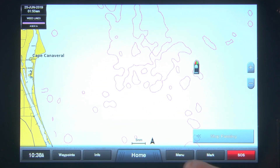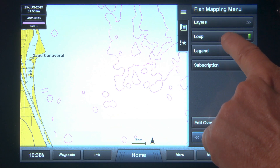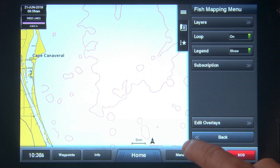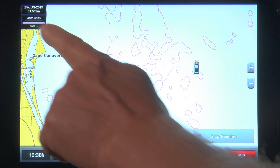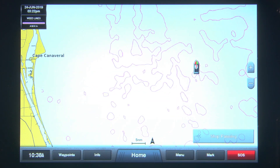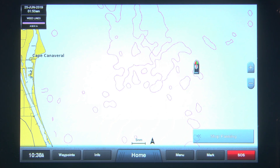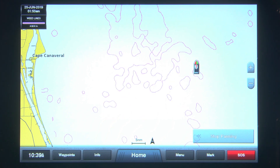Press the Menu button to return to the Fish Mapping menu. Next, tap the Loop button. You can use the Loop button to animate the most recent three days of weed lines as this data is available. The legend in the top left corner will show the weed lines timestamps during animation. Keep in mind that the ability of satellites to detect weed lines may be impacted by cloud cover or other occurrences. Weed lines are constantly moving — as such, we recommend that you monitor wind, wave, and current information to better predict the location of a given weed line.